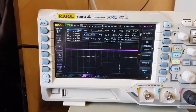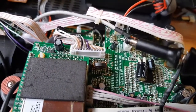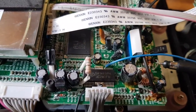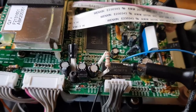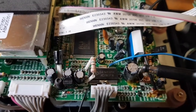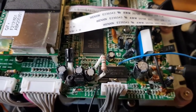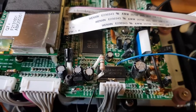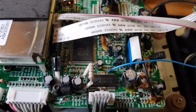There's quite a bit of movement on that power supply. The 12-volt line comes from a regulator up here, which is a nice stable supply. But it starts getting noisy further along — it gets noisier as you go through the diode, then the inductor, then the capacitor, and then into the amplifier — well, this is actually a sled driver for the motors. There's a cap here which smooths the supply. I suspect that cap has gone low capacitance or high ESR, so I'm tempted to either tack a cap across the supply or swap the cap out.